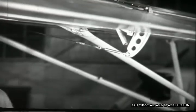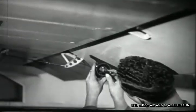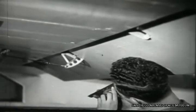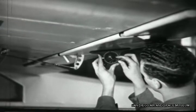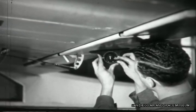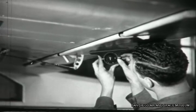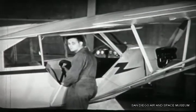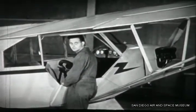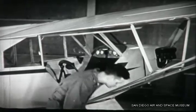Make sure the plane is level fore and aft. Then take the bevel protractor and measure the travel of the aileron to see that it's within the angular limit set in the specifications for this make and model of airplane. You can correct any error in the angular travel of the aileron by setting the stop nuts at the torque tube in or out. Adjust them until your measurements show the aileron is within limits. Then go back to the cabin and test the stick, watching the ailerons at the same time to see that they travel correctly. Then you can go ahead and safety the turnbuckles.